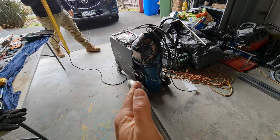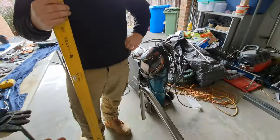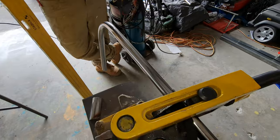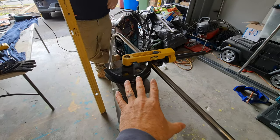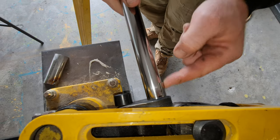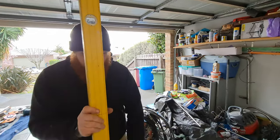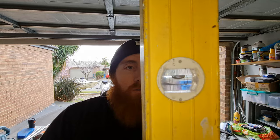Excellent question: how do you know if you're square vertically and square horizontally when you're bending? Because it's all well and good — if you put it in slightly off, you're not going to want to bend it like that. Then when you put it in the rod holder it'll be angled. One can assume that when setting up your bending machine, the square end matters. Horizontally you want it square — it makes life easier. I've got my little shim in there to protect it as best I can. It's not a professional-level bender, I'm not pretending it is. So you're going to square that up before you bend it.